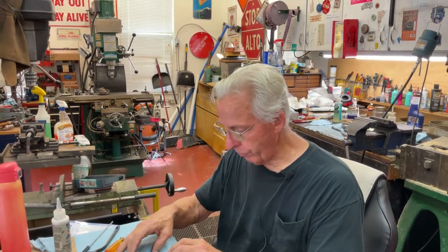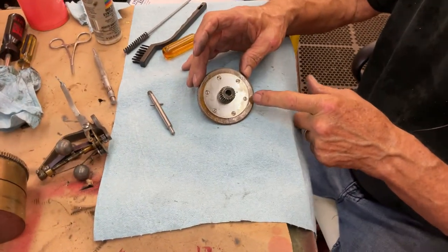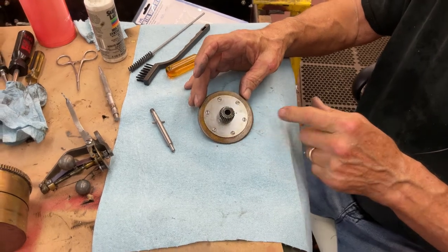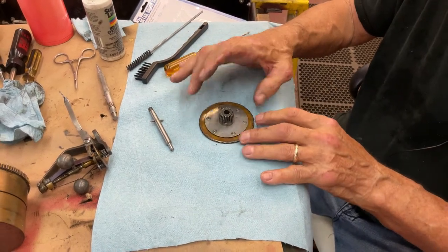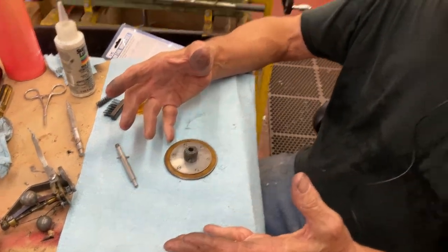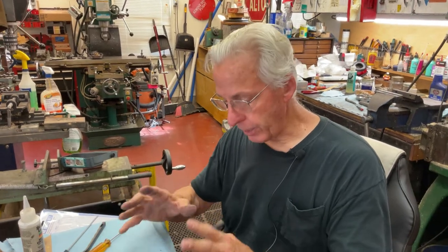Hi, Dyslexic Genius here. I'm back on the early Victor M, 1901, and I made a boo-boo because when you first look at this gear it'll look like it's brass, but on closer examination I found out it was a fiber gear. We want to take it apart and check the gear for cracks, because you don't want to get this whole motor together and on the 20th crank — playing a Berliner record you think is really nice — this gear lets go because it's fiber. So we need to check everything.